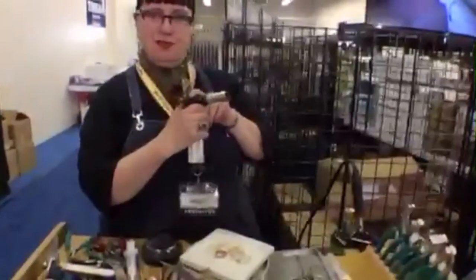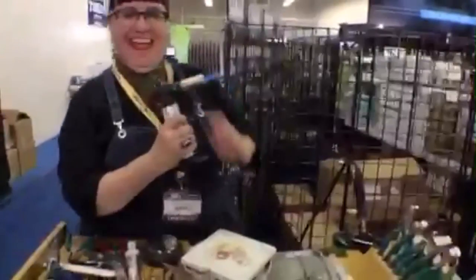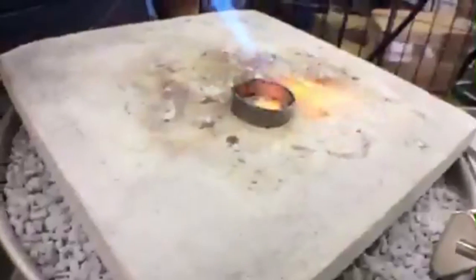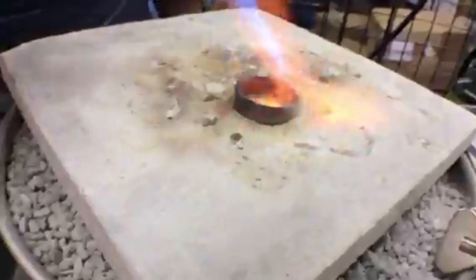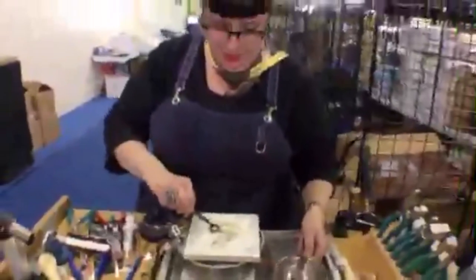Let me pop this on the soldering pan and get going. I'm going to come in and solder this now, getting close so you guys can see what's going on. Can you see that solder in there? I'm evenly heating that ring — even heating is key. Now as my solder starts to heat up, I'm going to come in right with the sweet spot of my torch. There we go — can you see that solder flow? I pull the pan around and get that solder right through the joint with the flame. That's what makes this my favorite soldering tool.